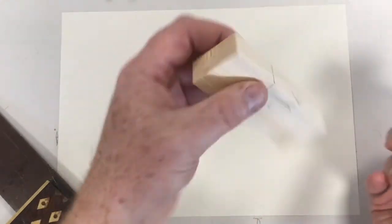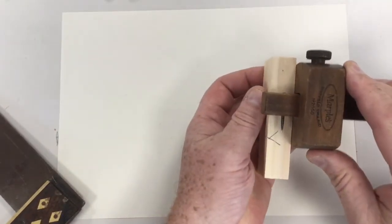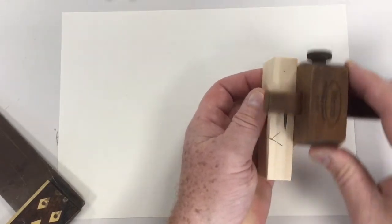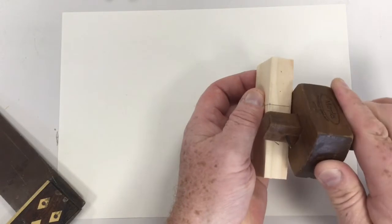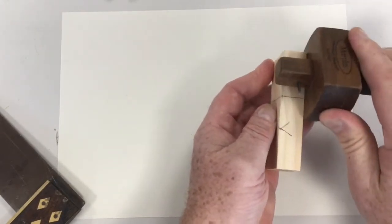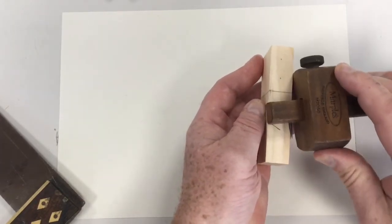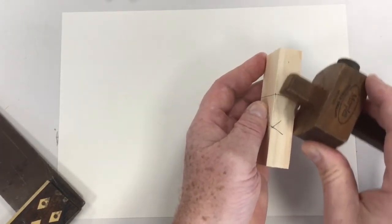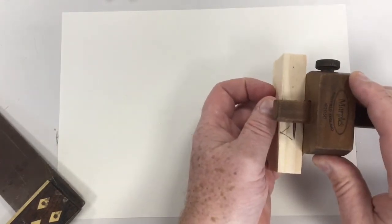Now, if you take your wood, you can practice first of all, making sure that you use this properly so it slides along the edge. Make sure you're able to do that, slide it along the edge. Ignore the spur just now, that's not important. So get into the habit of being able to slide it backwards and forwards so you get a parallel line. This is no good. It has to be held in tight, okay?